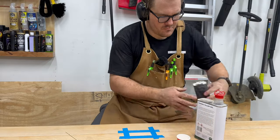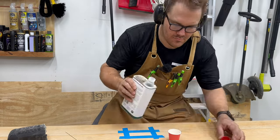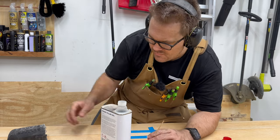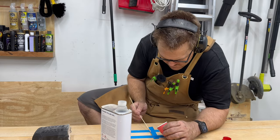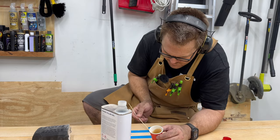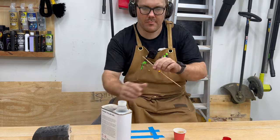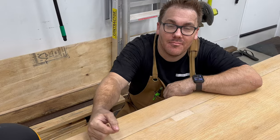What you see me doing here — off camera I sanded up some American oak and I've got the sawdust there mixing in with Fiddes filler gel. It works really well — it takes stain and finish very well. I'm just mixing it up and putting it into those hairline cracks you see just around the inlay, hopefully to blend it in seamlessly with the wood around it.